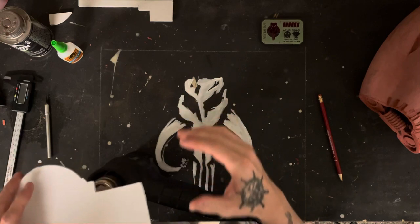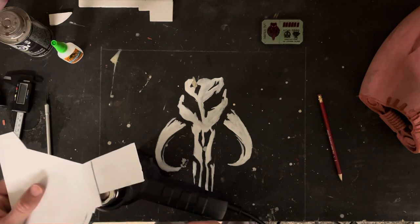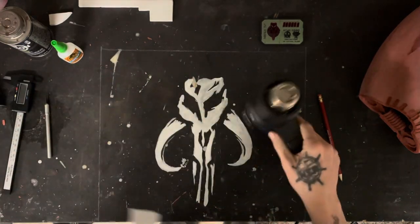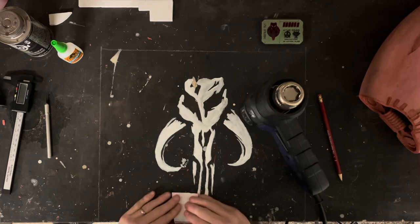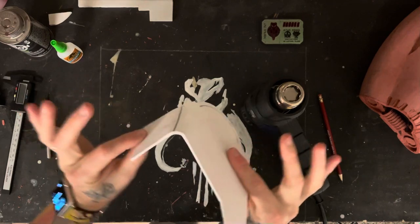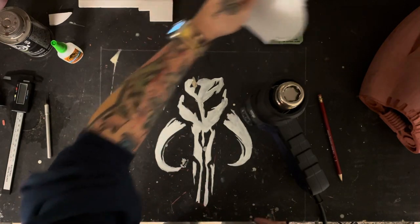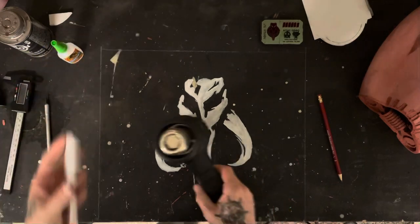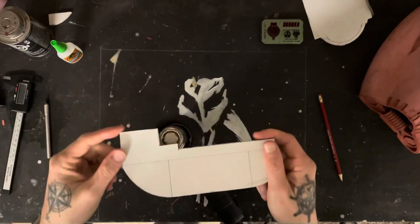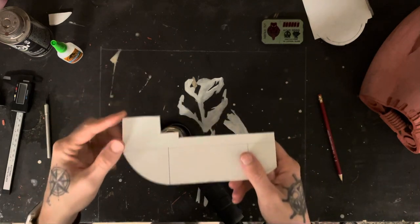Make sure you flip both sides — I've found that makes it a lot easier, especially with six millimeter. If you don't do that, you're working against the material itself. You can already tell with the three millimeter that it's bent on itself. You can bend it around an edge of something if you want. It's stiff now and it will stay like this until I heat it up again, and then it will want to go back. For six millimeter, it's going to take a lot longer to heat up and it won't do that warp-bend like the three millimeter did.